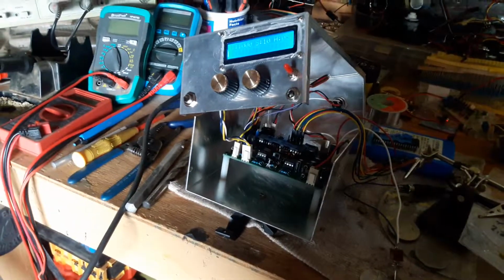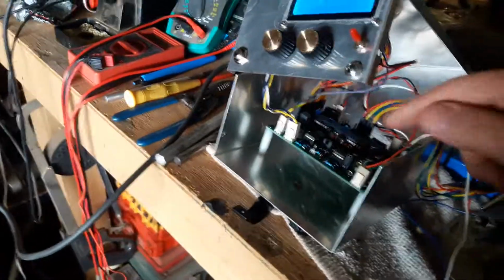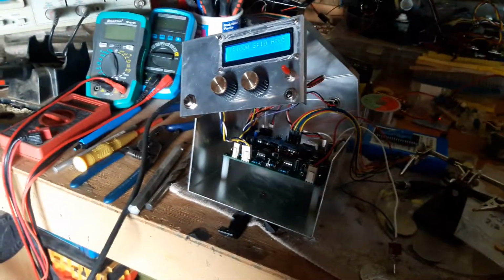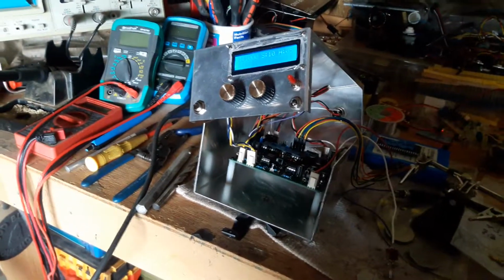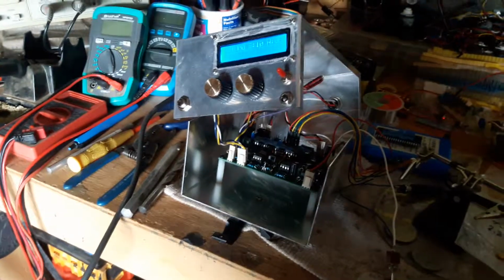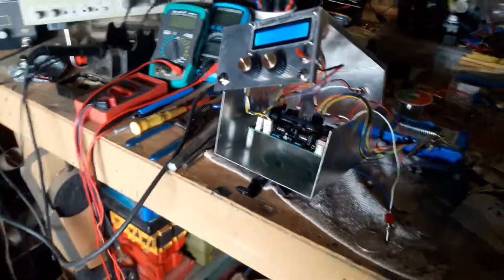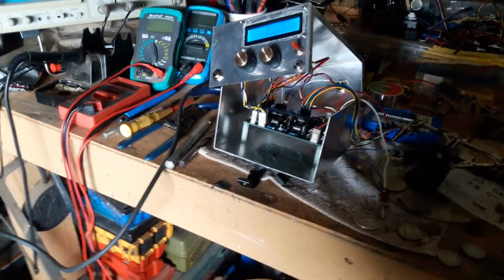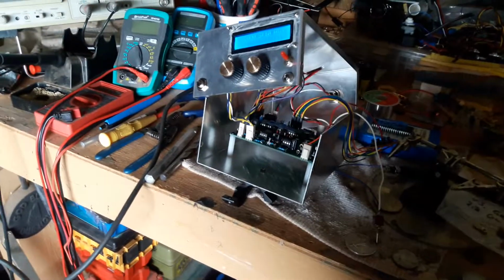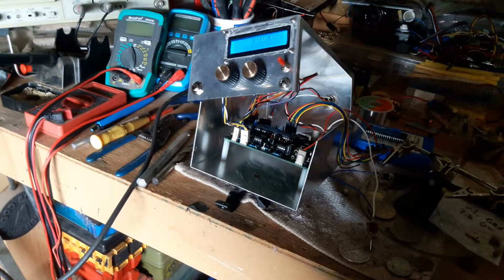So I did do a comparison test. I have my test code chip and the full code chip. And with the test code chip in there, I don't know what the difference is, because I think if I remember right, we set the test code, was it 1000 PPS as well, but I'm not sure, so you'll have to remind me if it was or not. But for some reason the test code, the coins are all around 10 inches, as is the gold ring, and the gold nugget is about 5 inches. And then, like you just saw with the full code in there, it drops that down a little bit. So I'm not really sure why or how that's doing that.